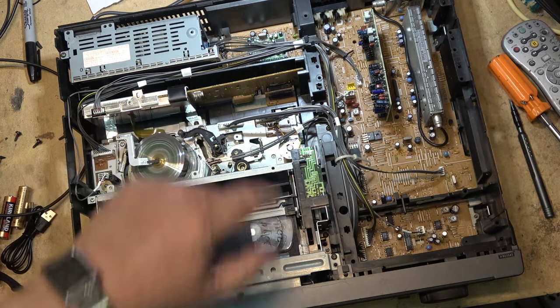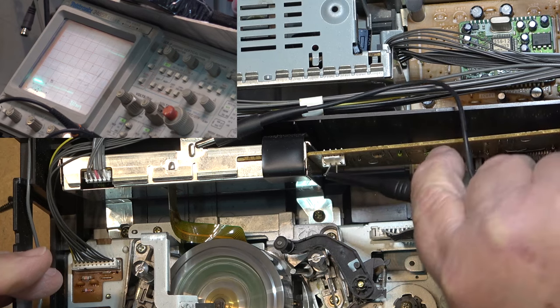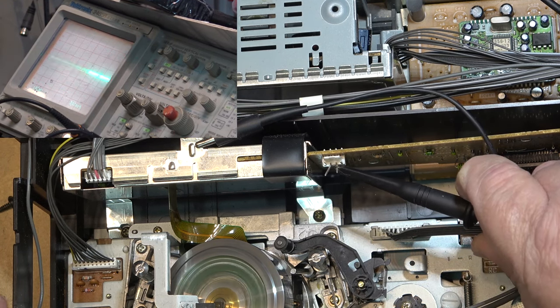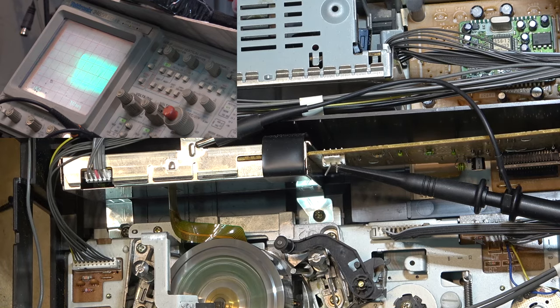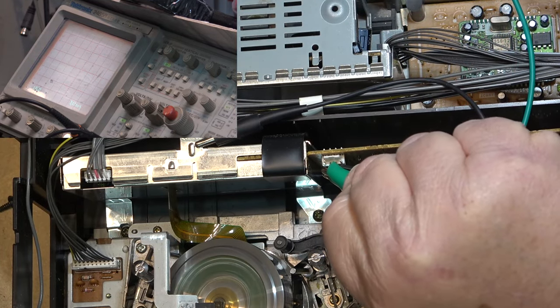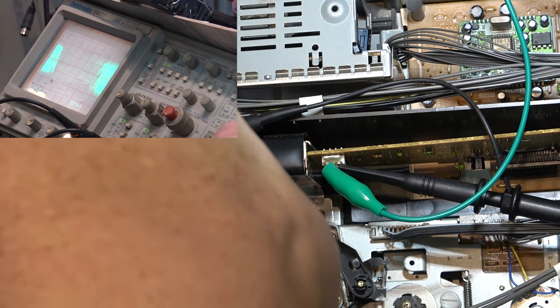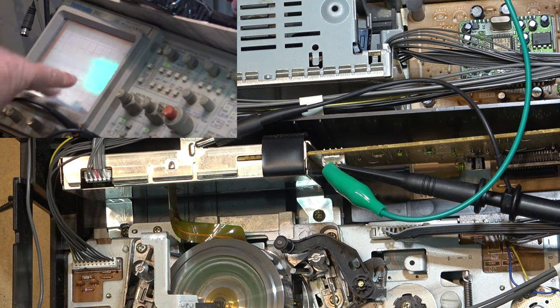We need to find which test point is RF and which is the switch pulse, because we need both. With the Sony probe you'll see that one pin here has the switch 30 signal - that's the switch signal required to synchronize the scope - and the next pin here is the RF. I'm going to use an alligator clip on the switched signal and set the scope up on channel 2 for triggering, with channel 1 displaying the waveform.